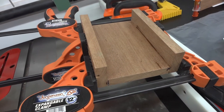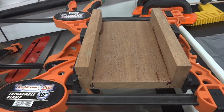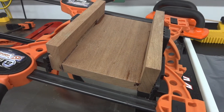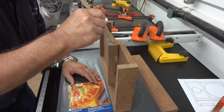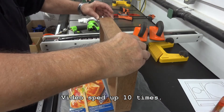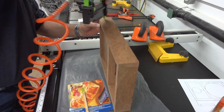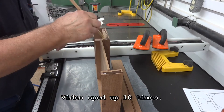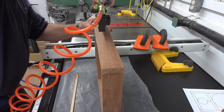Now the clamps are on and the pieces aren't sliding around. You're going to notice that the epoxy glue did darken the mahogany — well that's okay, because the Varathane is going to darken it exactly the same, and you won't be able to tell where it is. These are the last two stages of the glue-up: I'm going to put one side on, wait about an hour, and then put on the other side. And there, that's it — it's all basically put together. Just a lot of removing excess glue and sanding, and then I can put the Varathane on.